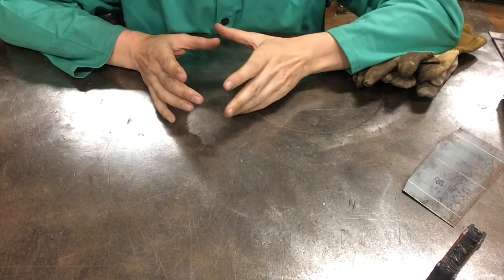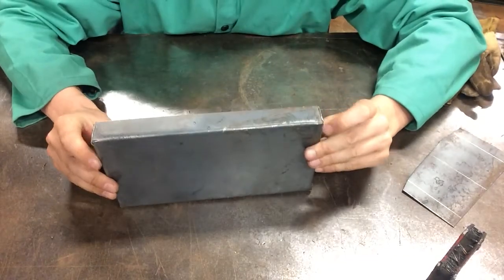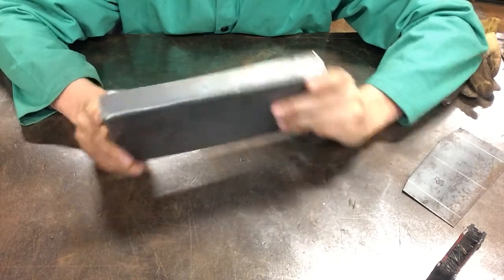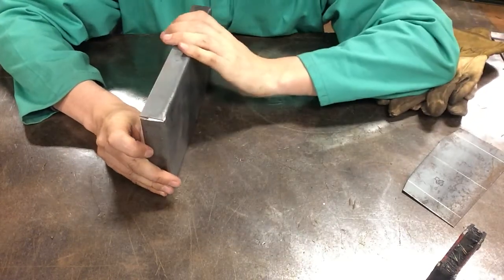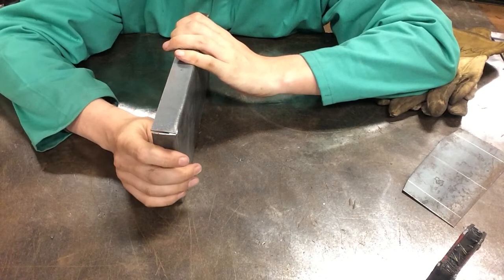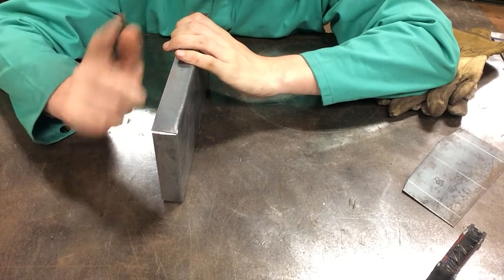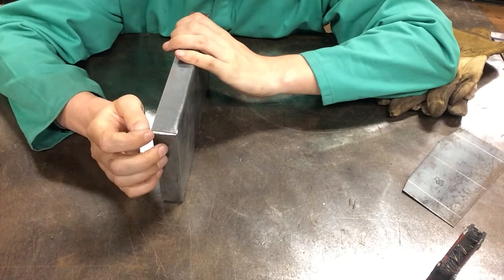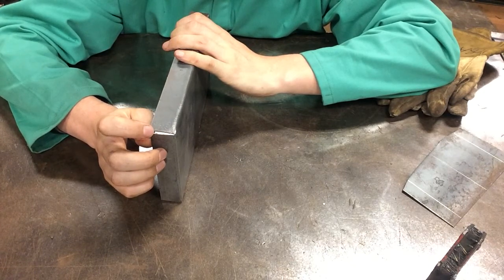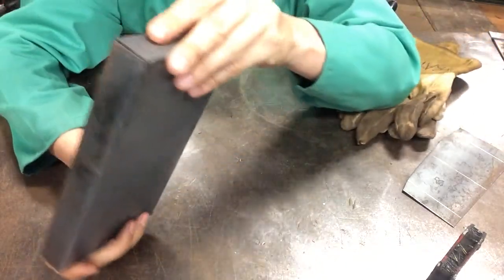Let's talk about practical welding applications. Often when you're doing fabrication you're making things that are boxes or geometries where you need a lot of alignment. When you start to weld two pieces of metal together, the gap or tolerancing in your weld is going to matter — relative to the wire feed coming out of your welder as well as the voltage. If you have a larger gap, it may be a good idea to turn down your voltage or increase your wire speed so you're filling with more material.